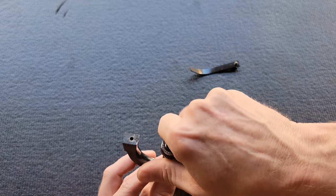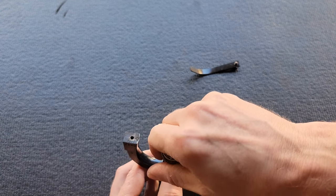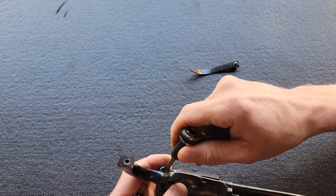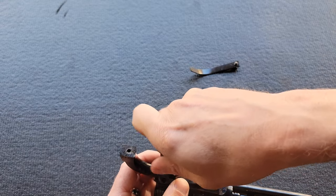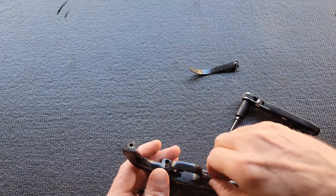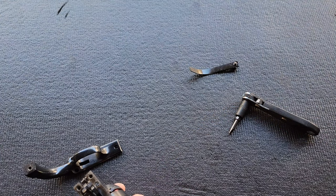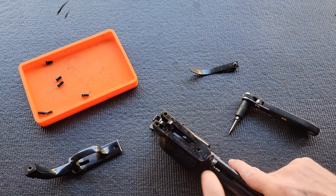Those all broke free, remarkably easy. If you're familiar with these guns, you know that if you're shooting them with any volume you want to check your screws periodically — they will walk themselves out, and losing one at the range is not cool. When I was shooting SASS I'd keep a full spare set because you will lose them. Let's see if I can get that out with my fingers. And that reveals, as suspected, a flat spring for the bolt. That is not what we want, so let me mop this up and get into that flat spring.